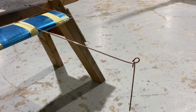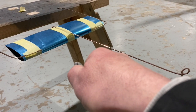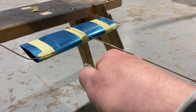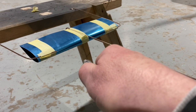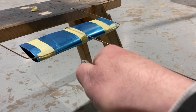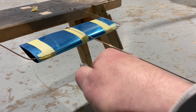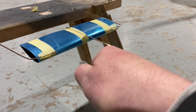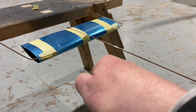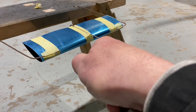I've added a little bit more mass there. Now we are pretty stable. Some of that movement you can see is just because it's a bit springy and I'm moving the blow gun around. Even getting quite close with a strong airflow — there's 150 psi there — it is not fluttering as such. That is a usable control surface.